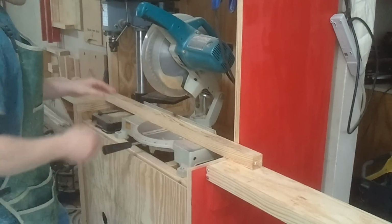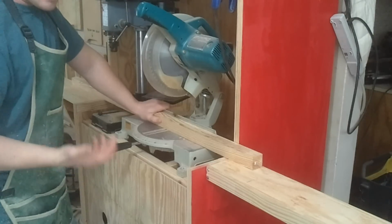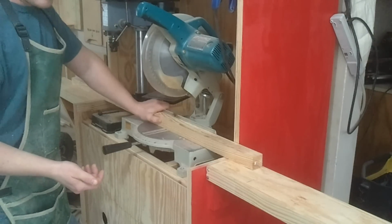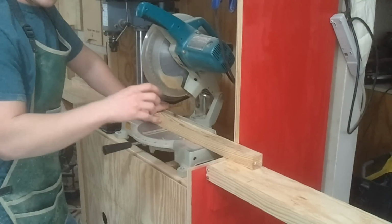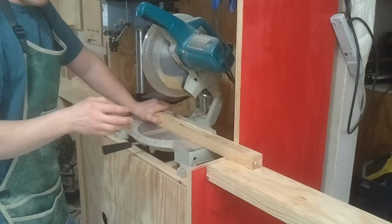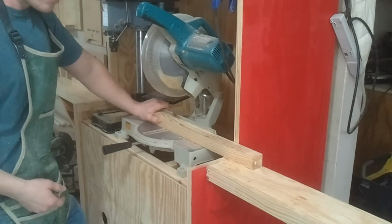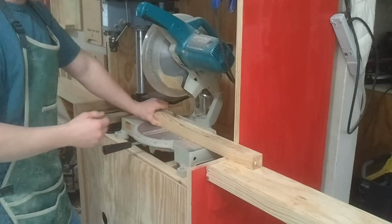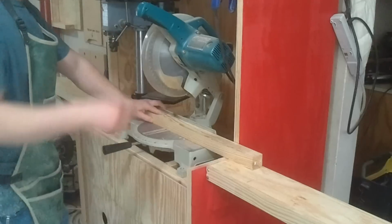for my vertical pieces. I said the distance wrong earlier. I said it was 17 1/4. I took into consideration the thickness of the top horizontal piece, but I'm not going to use a half lap joint like I originally thought. I'm just going to go ahead and pocket hole screw this whole thing. So my vertical distance is 15 3/4, which is the same measurement of my frames.